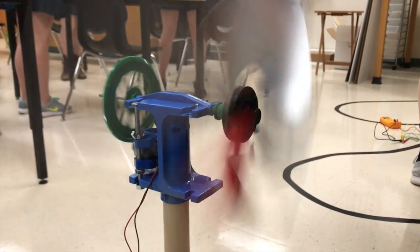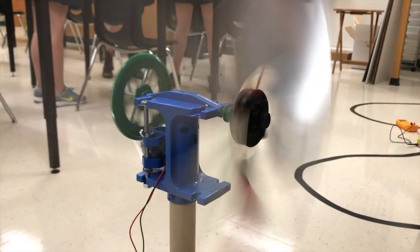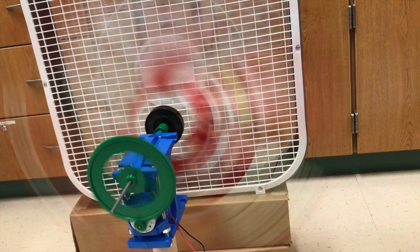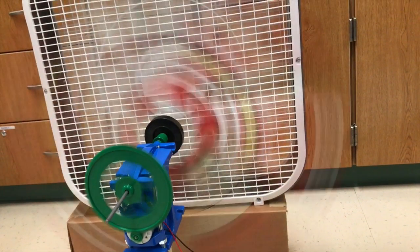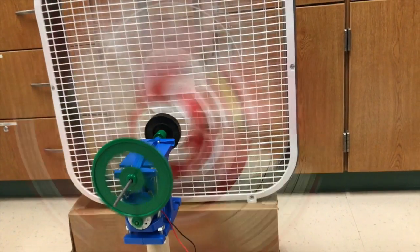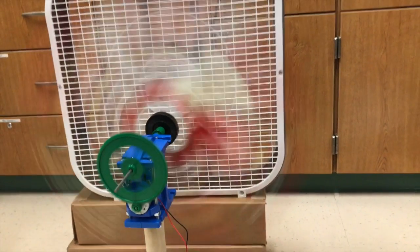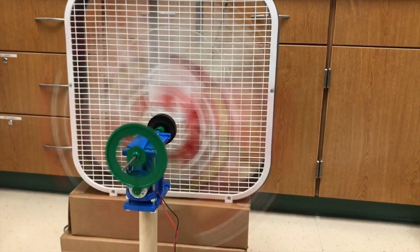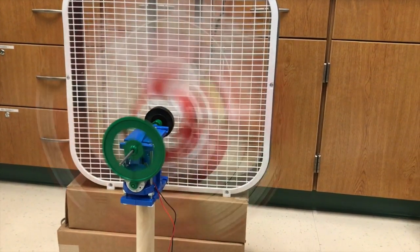The curve of the blade, due to the shape of the Pringles can, creates a curved airfoil blade to produce better performance and higher rotation speeds. We also chose to use a Pringles can because it is lightweight but also sturdy and would not need reinforcements, which would only make the blades heavier. The lighter the turbine, the faster it is able to spin, producing more energy. The Pringles can is also aerodynamic because it is very smooth, allowing for better and faster airflow.